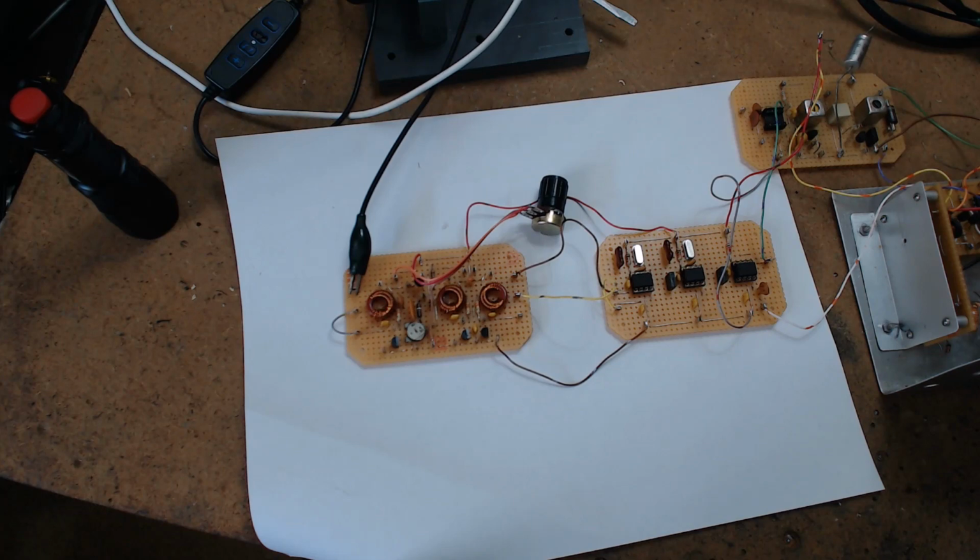I never realized the R71A, it picked up a lot of stations, but it also picked up the noise from its display, its processor, its mixer made noise, and when you're in sideband, it worked great. You didn't notice anything. Then you go on shortwave, and it wasn't that great. I mean, it just didn't sound like an old tube radio. And then I found out that they put the wrong value in the tone section of the radio. I'm the one that figured that out. So you disconnect that capacitor. Now you get the high end of your audio. There were guys that did all kinds of mods on that radio to try to fix the problem, when really it was a design error.